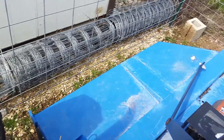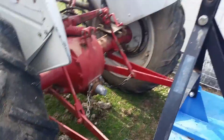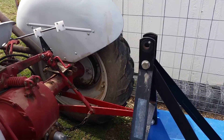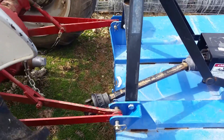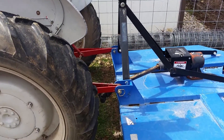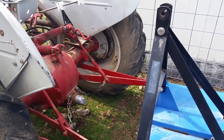Right now I've got the three-point mower behind the tractor and I set it up a little differently than most people do. The mower has the three-point connection — I use the two lower lifts but I do not connect the top link. My pasture is totally flat so it really doesn't need it. What works out well is the tractor is holding the front of the mower and the tail wheel is just dragging behind. So it's not exactly how it's designed to be, but the tractor does a lot better because it's not trying to hold the mower up in the air, which would take away from steering and make the front end really light.